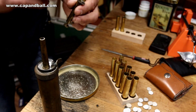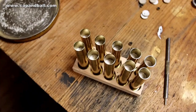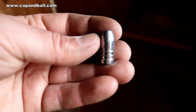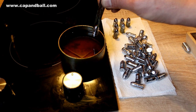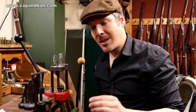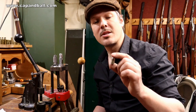The next step is placing an 11.1mm cardboard wad, which protects the base of the bullet and improves accuracy. The bullet comes from a Lyman mold especially designed for the 11mm Mauser cartridge, weighing 23 grams or 354 grains. For lubing I use my proven recipe: eight parts tallow, two parts beeswax, and a small touch of synthetic engine oil. Then I size the bullets — although my rifle's Alexander Henry bore is slightly smaller than original Mauser military rifles, I'm using the .446 caliber sizer because I know this bore was designed for this bullet size.